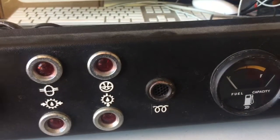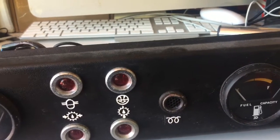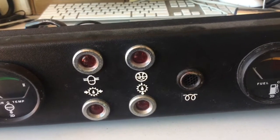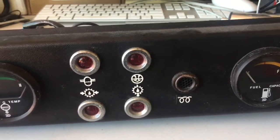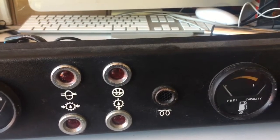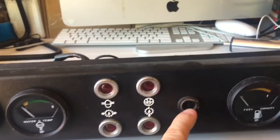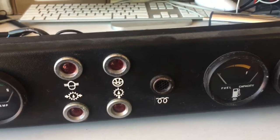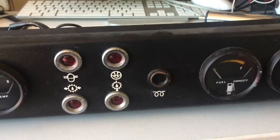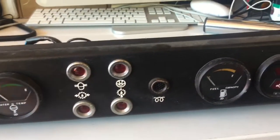So back on to the reason I'm now looking at this. When I've fixed up the starter motor and all the other wiring, I'm now getting the Bobcat cranking over quite nicely, but I feel like the glow plugs aren't really getting hot enough — something's not quite right. When I did the rebuild and opened up the sensor, I found that inside it was just a piece of wire, and when I first turned it on and applied current to it I actually got a red glow out of this sensor. Most recently I checked the voltage across the sensor and also across the glow plugs, and I'm seeing about 8 volts drop across this sensor and about 5 volts drop across the glow plugs.